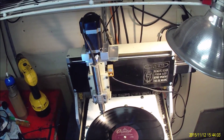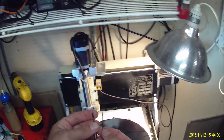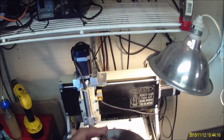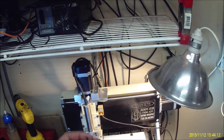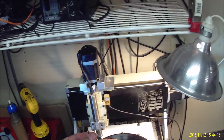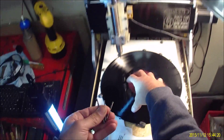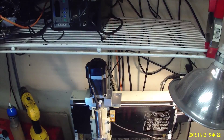So I've gone to single-flute end mills. They're basically one cutting edge with a high helical channel to pull the chips out. Just like a standard end mill, that helical angle pulls the plastic material up.